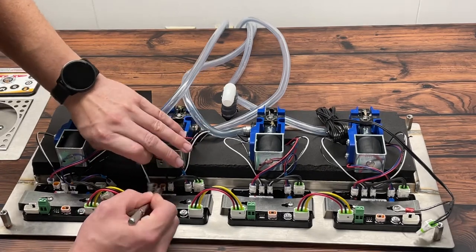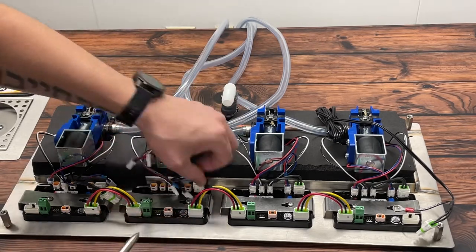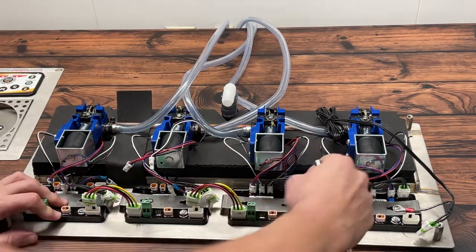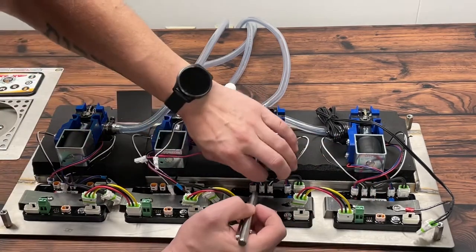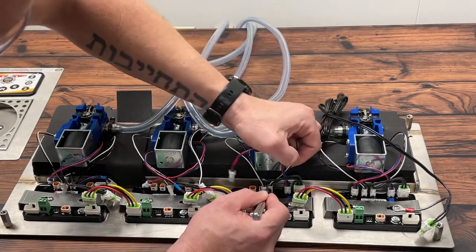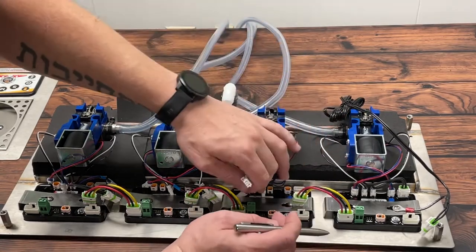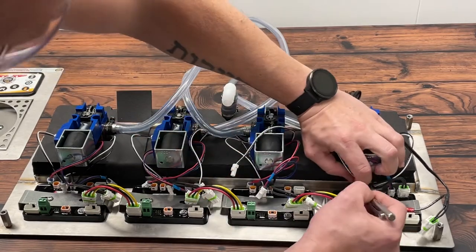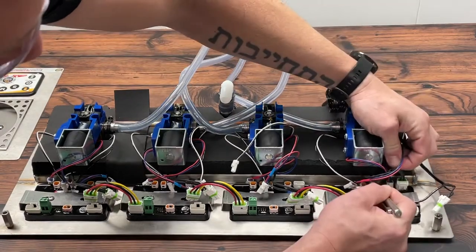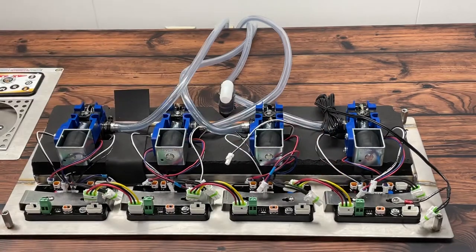You're going to unplug every one of the sensors, every one of the LEDs, unplug the solenoids, and take the jumper wires and disconnect them. The reason we do this is so we can isolate each individual component and bring it online in a controlled fashion to check whether or not the fault remains. Unplug all the circuit boards and all of the sensors, making sure that the first circuit board isn't connected to anything else.